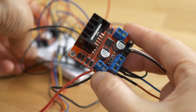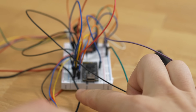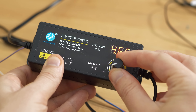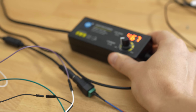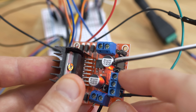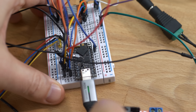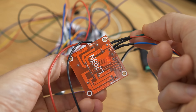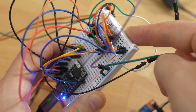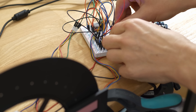Now to the wiring. The LEDs are connected to the output of this driver, and the input is connected to the microcontroller. I attached a variable power supply as a power source so I can play around with the voltage. These screw terminals come quite handy. This driver also has a 5V output that we can use to power the microcontroller later. If we power it from USB, we at least need to connect the ground. The Pololu-style stepper driver boards have a few more connections, but I linked a schematic for your orientation in the description below.